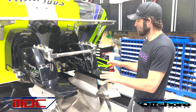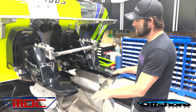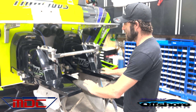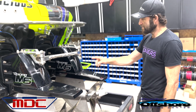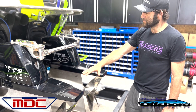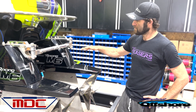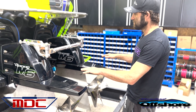Now I'm going to show you how the trim sync works on this. Hey Brandon, if you bring up the starboard side — good right there. So now these drives aren't even. If he taps the both-up switch, this one is going to come up. Now they're perfectly even — it automatically did that. It read that starboard was higher than port and recalculated. So now if we bring starboard side down — and we want this side to meet up with this side — tap the both-down switch. This is automatically doing this by itself. Hit both up, let go — it recalculated, raised itself up. Hit both up again, let go. Now they're parallel, stays the same.